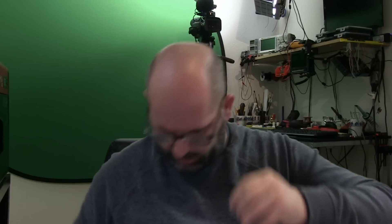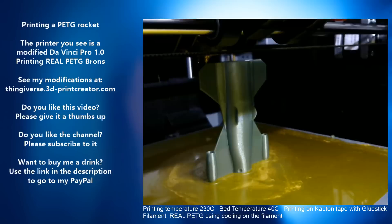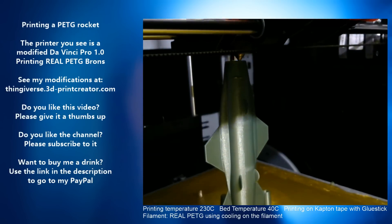It's very very strong. I didn't believe it when I saw it for the first time, but it really is as stiff as can be — you can't break it. You can't print this strong with PLA, you can't print this strong with ABS. It's extremely strong and a bit flexible as well. Then I printed a rocket — completely filled — and it turned out great. But I had to print two of them, because the first one at 230°C didn't come out that good. I had to go to 245°C to get a good print.